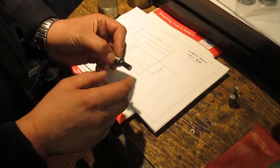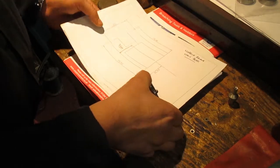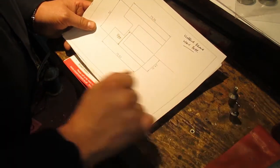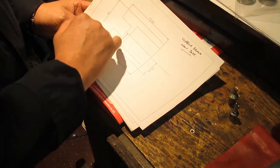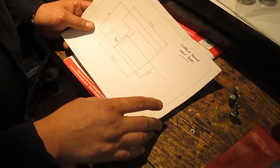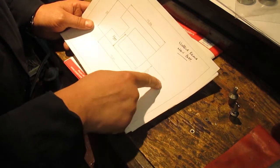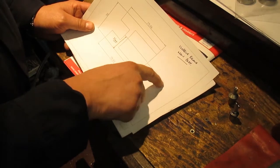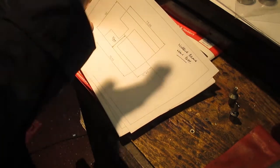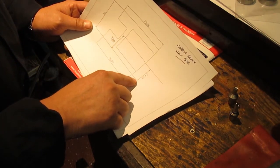They all have a 12mm shank at the base and from the shoulder to the top they're all 25mm. That allows me to work out exactly where I need to tilt from. I've drawn this initially square or parallel in the bore, added the holder, and then added the tool bit within the holder. Once I pivot from here - because this will be the centre of the workpiece - and drop down one degree, from the outside edge once this is flatted off across the top at one degree, it gives me a dimension of 24.31mm.